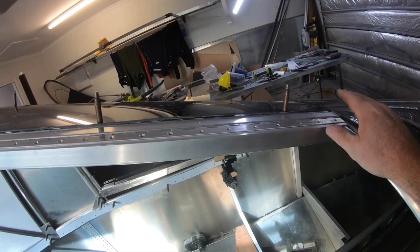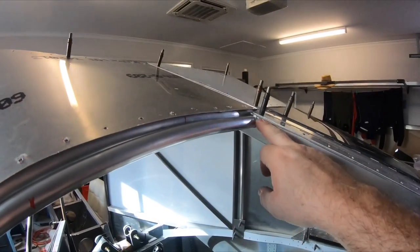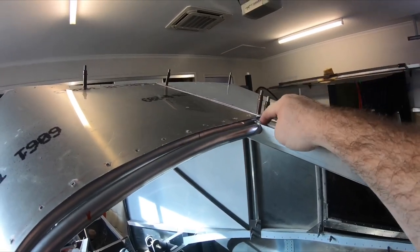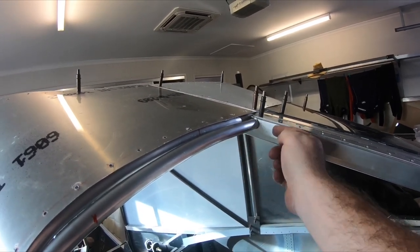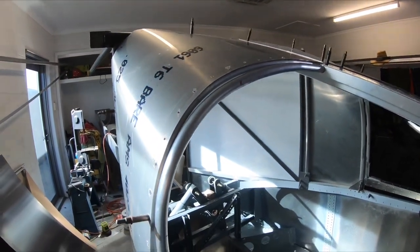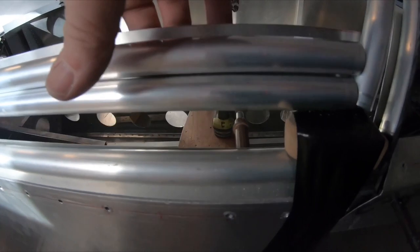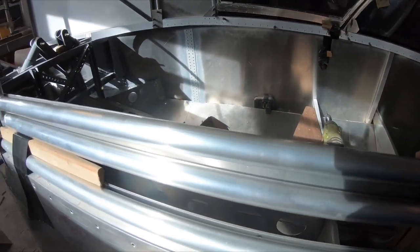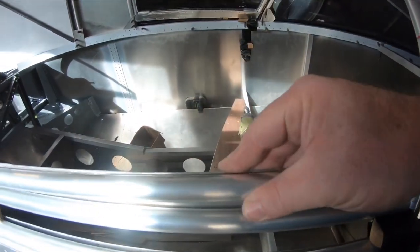You could end up cracking these or popping holes, which wouldn't be good. So we fix it down underneath so it's completely rigid, then the screen goes on top. What I've done up here is put these hole saw holes through so the tube goes through and is fixed there. We've also got brackets going in there and across the bottom as well — a fillet bracket. Down on the bottom I've got two tubes — very lightweight tube — but what they're doing is stiffening up this whole bottom section so you get no flex in that bottom rail.